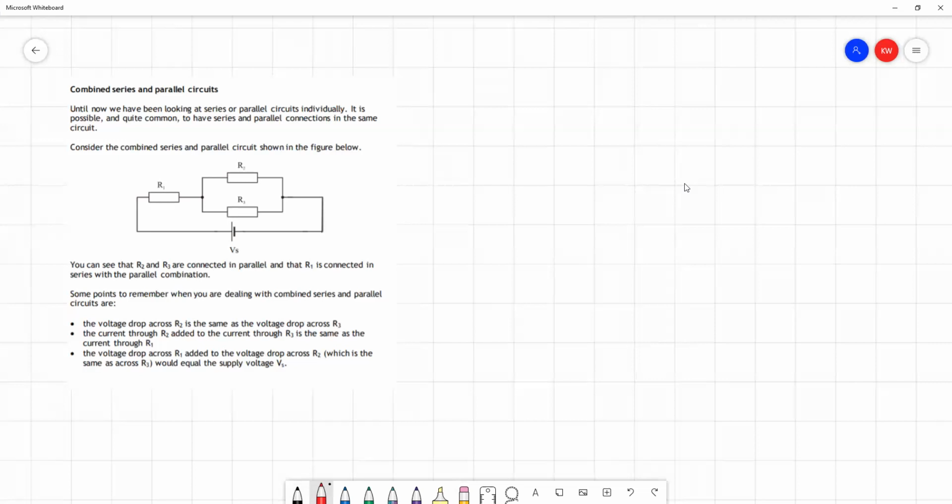So what it's saying here is we have a voltage that we would measure in this branch. I should really draw this as a little voltmeter. So we'd have V2 here, V3 like this, if we're measuring the voltage dropped across each one. And what we're saying here is V2 is equal to V3. So whatever the voltage is across resistor 2, it's the same as V3.